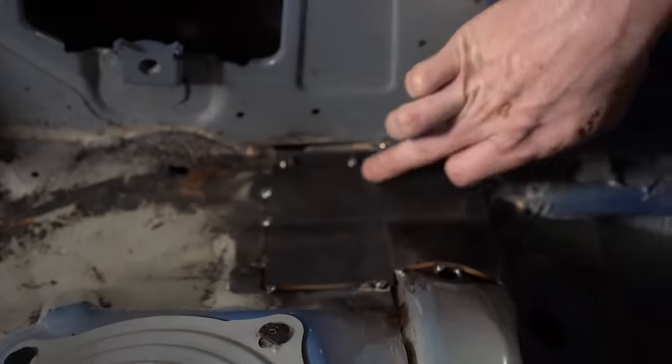And nobody likes too short of a main hoop, especially inspectors. If you have too much of a gap between the main hoop and the roof, you will fail. I think drifting's pretty lenient, but other series like Champcar or Rally and FIA, they're not lenient at all. So cut it too long if you're going to cut it anyway.